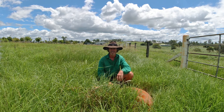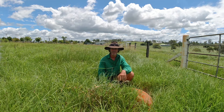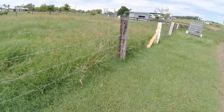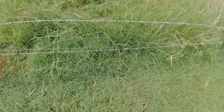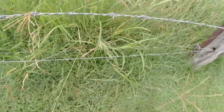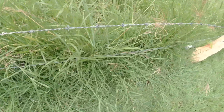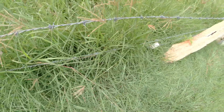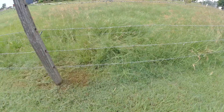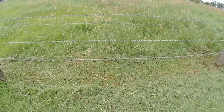So I've only got one other option, and I'll talk about that now. What I want to touch on is growth — whether it be trees or grass touching the electric fence. As you can see, we've got a bottom wire here in our training paddock and the grass is coming all the way through and touching that wire. That's zapping power whilst it's in contact with that growth. So I'm going to go along and whipper-snip that bottom wire and clear that growth off.